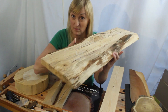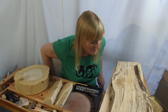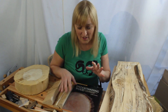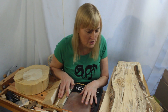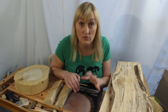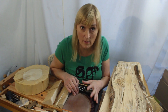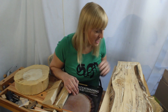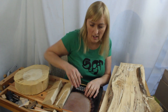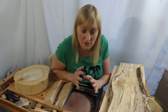I love this wood and it's stable. It might not be as strong as un-fungused sapwood, but it's perfectly usable and is used widely in the guitar world. There is one other aspect of sapwood that is different to heartwood: when it's green, when it's freshly cut, there is a lot more moisture in the sapwood. So you have to be careful to dry it properly. But once it's dry, it's perfectly stable — no longer any problems with the fungus continuing.